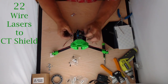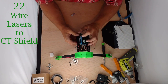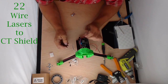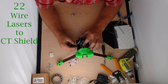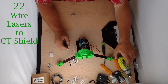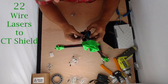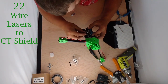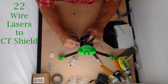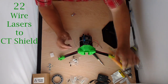Now in terms of hooking up the machine, you can see there are silk screens on here. The LDR, ground, and LDR1 sensors — we're not going to use that block. What we do want to use first is for the LED: we have LED positive and ground. We're going to take a small flat screwdriver and open these up. The white wire is going to be your positive wire — that goes into the LED plus terminal. The gray wire is your negative wire — that goes into the ground terminal.